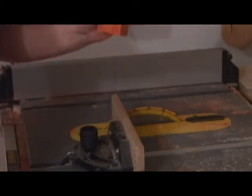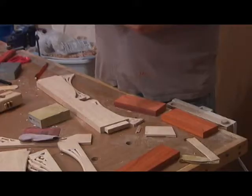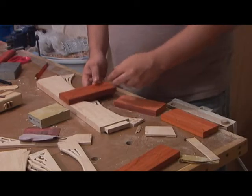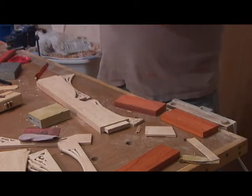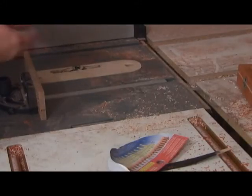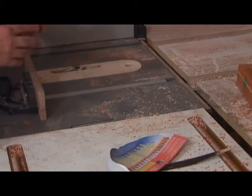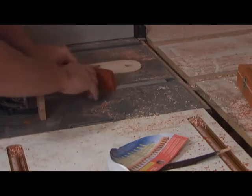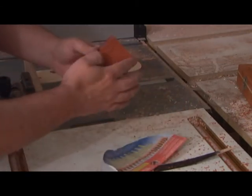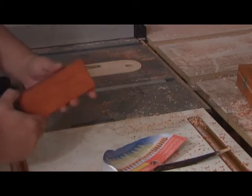I'll rough them out — actually I need to figure out how to go ahead and do the milling first. I'm going to remove a good chunk out of the back on each one of these to bring that down closer because I don't want it up so high. The lower half will be full so I can shape it. I'll put in the dado stack, set the blade height, and remove some of this bottom material so it'll lay closer on the board. Then I'll cut a dado up here to remove this back section, and cut another dado over here to recess it in. I'll trim everything up at the bandsaw.